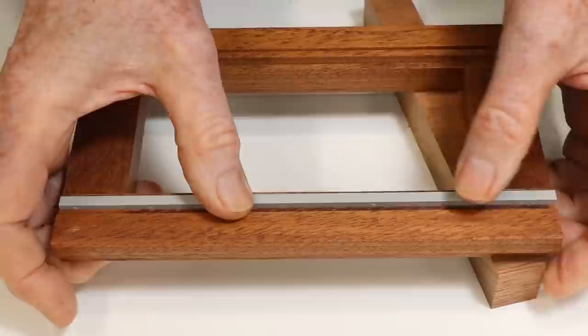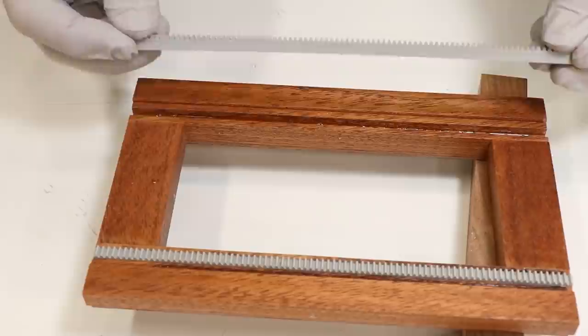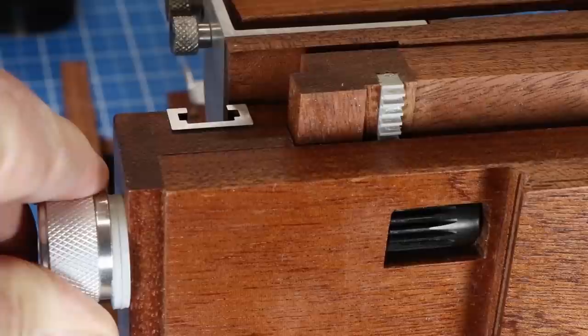However, that also means that glues do not stick very well to slick, glassy, smooth surfaces. So I texturized the bottom of the racks with a tiny drill. I set them in epoxy, which has pretty good mechanical strength. It'll lock these tiny holes together. Here's a preview of how this rack and pinion system will work after it's all assembled.